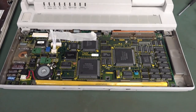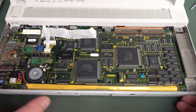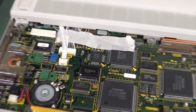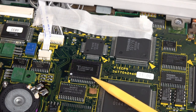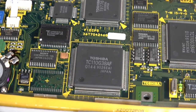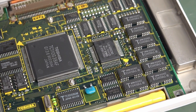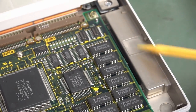Toshiba Custom A6 chips - three of them. One is the processor. Is that our socketed ROM? Our DOS in ROM? That looks like it's in a surface mount socket. Day code is week 26 of 1990 - so latter half of 1990 build. There's our 1MB of memory on board and there's the expansion socket. There must be a surface mount connector on the bottom here where you plug your card in.